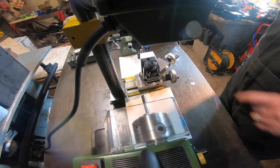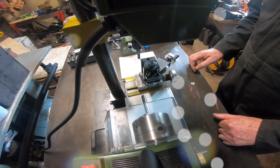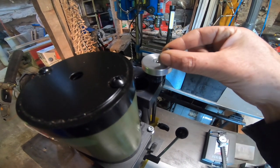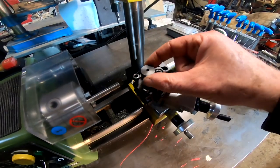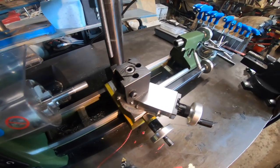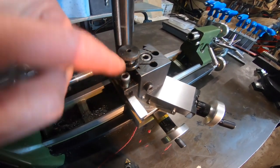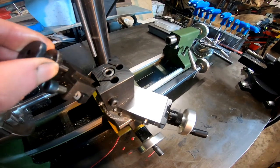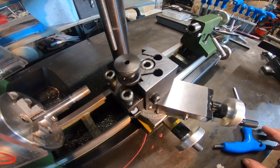And who's noticed how awful turning brass is? It goes everywhere. If you have to buy just one accessory for your lathe, get the quick change tool holder — you will not regret it. It's fantastic. You can set the height of the tools, lock them and swap them just like that and then tighten them up. Highly recommended.